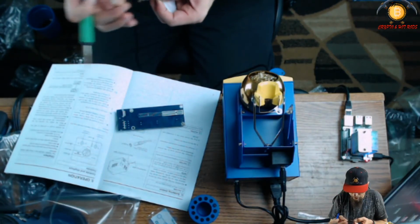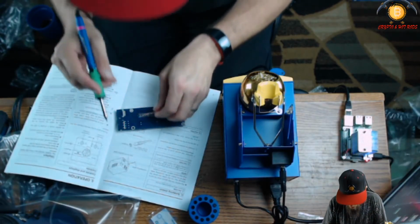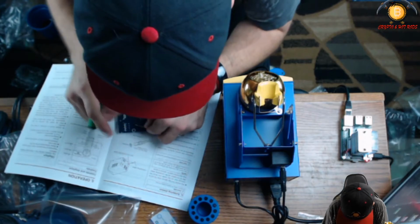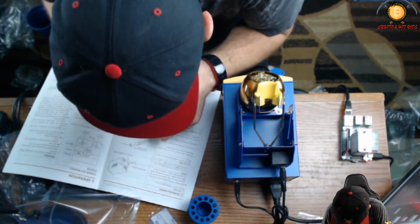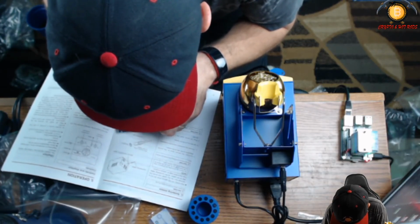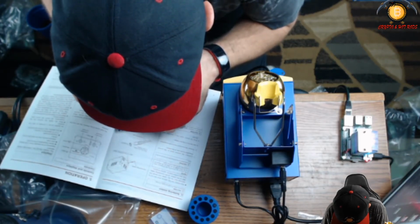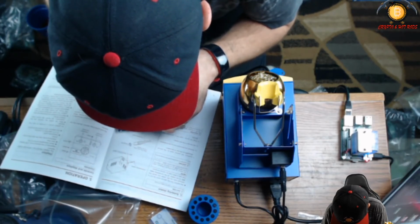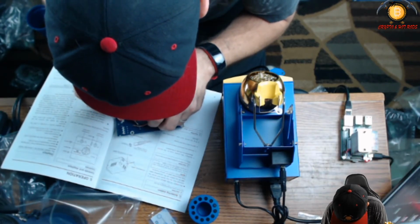And guys, if you've never used solder wick before, if you take the heat away from it, more than likely the solder that's in the wick will re-solder itself to the component you're trying to take off. So just remember to lay it down and then use your iron to drag it around. Otherwise you're not going to be a very happy camper.